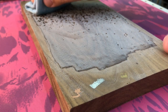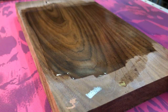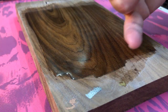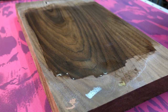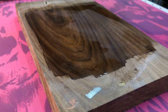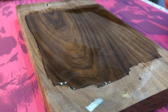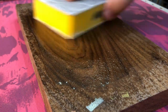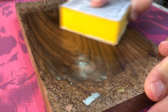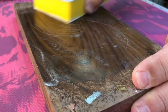Here's what it looks like as I wipe it down with some plain water to get the sanding dust off from the random orbital. You can see it's actually pretty good. What you can't see is that it is a super smooth finish and it's actually a little bit warm to the touch right now because I think it's still undergoing a little bit of its curing process. Now we're going to go ahead and hit this with just a wee bit of the 400, which it already has, but let's go ahead and do it anyway. Nice uniform grit. Good news is there isn't a whole lot here to polish up.